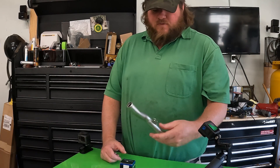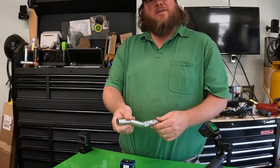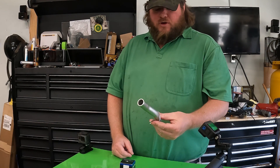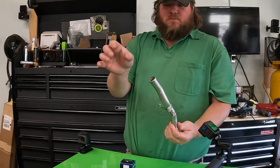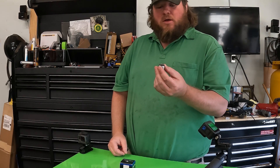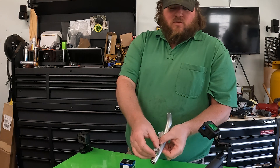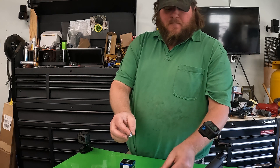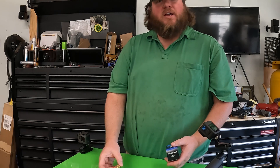These are the parts we're working with today. We've got the John Deere suction tube for the 2014 and above 1025Rs. The 1023Es and earlier — the 2013 and 2012s — had a different model suction tube that was actually bolted onto the pump, whereas this one uses a rubber elbow. We have the NPT bung — this is a 3/8-inch steel bung that we're going to drill a hole in and weld on there. The previous one I made I did with the MIG welder, but my TIG welding skills have gotten a little bit better, so we're going to be using the TIG welder.